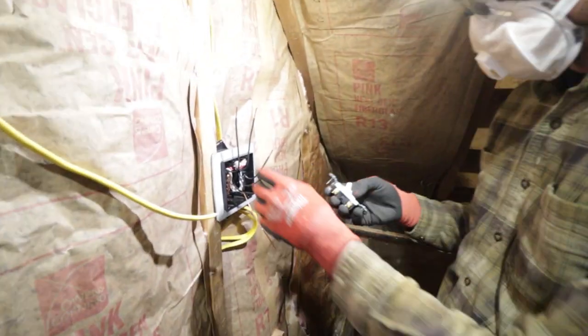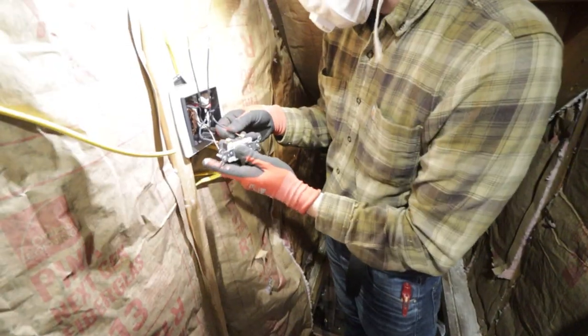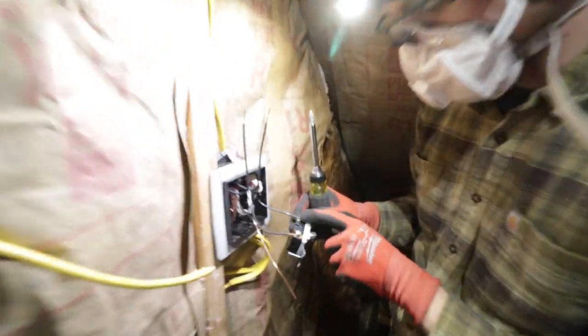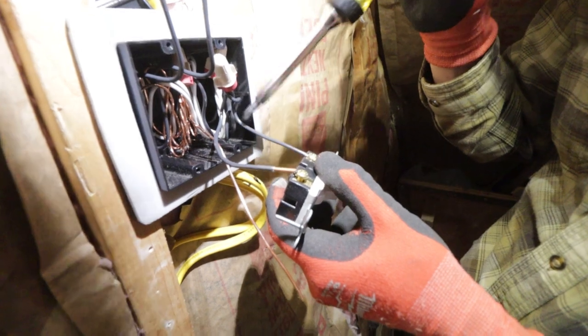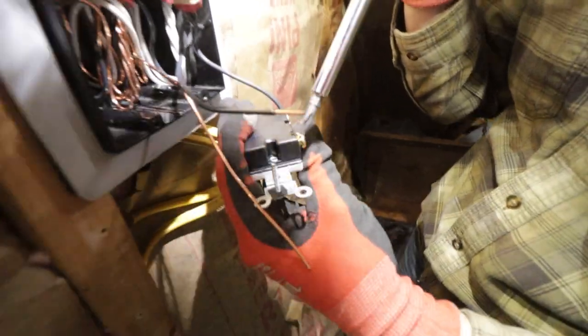This is our light switch, it's a 20 amp rated light switch. These are also commercial rated, so instead of having to wrap it around the screw, you can just slide this in the back like that and tighten the clamp down onto it. Another thing we could have done, had I realized that it was these types, I totally forgot, is we could also take a jumper instead of making the splice here and jump out to the other switch. So you can have two come out of here. See, yeah, there's a spot for two on either side, but that's okay.